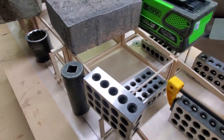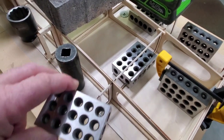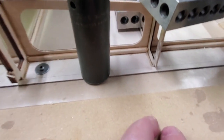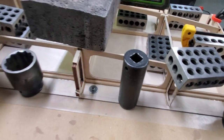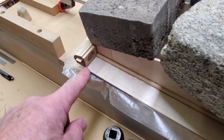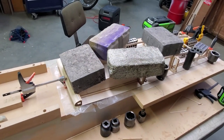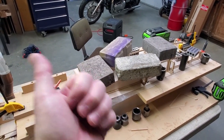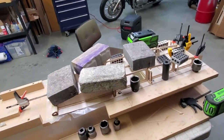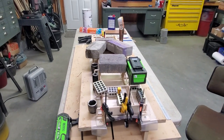I've weighted it really well. You don't have to worry about doing fancy fillets in here yet because we will do that later. There you go — I laid a nice fillet in here. All right, if yours looks like that, the next thing I want you to do is walk away. Leave it alone — don't take the weights off, don't take it off the jig. Leave it there, go do something else for a while. We're going to meet again — see you soon.